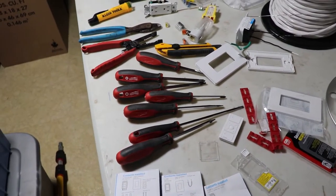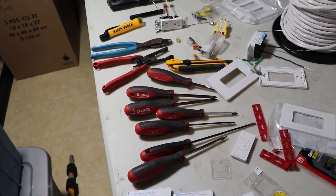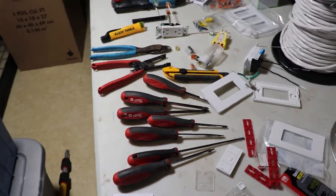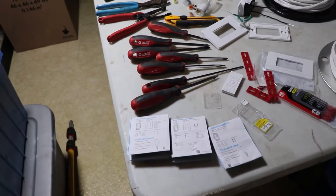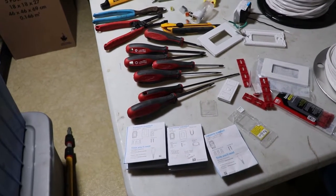So if you're having trouble in a switch situation like that, it might be that you don't have any lights in any of your sockets or something. So you would just need to put in some lights so that you can program it. Because if you're in a house that's just being remodeled or something, it won't work without lights.